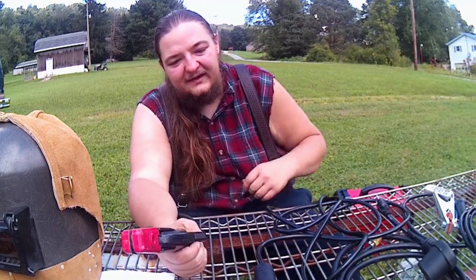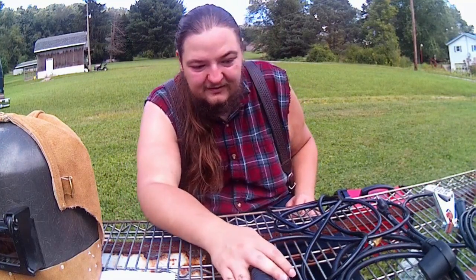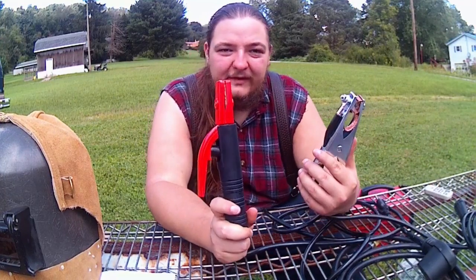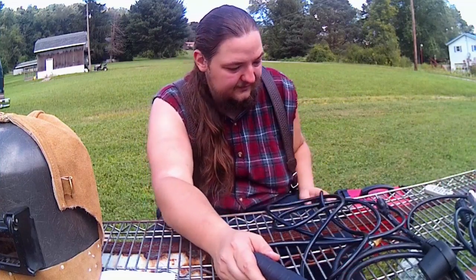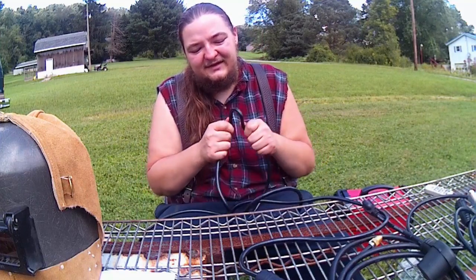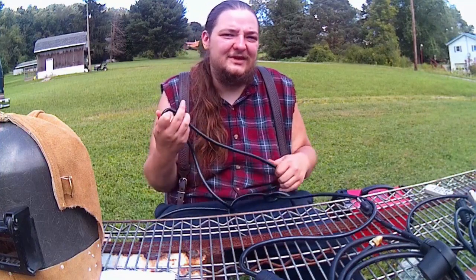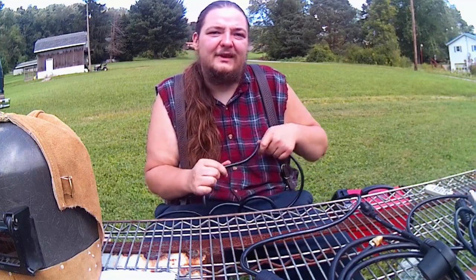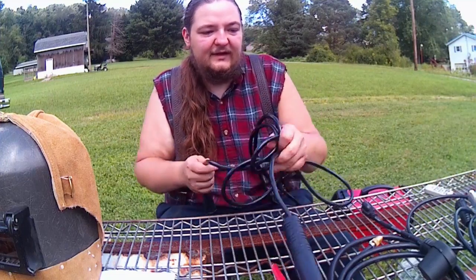So, that being said, the only thing I would tell Arccaptain about the leads and the ground clamps is, that's okay. These are consumable things anyway. You're going to replace them after so long, especially the ground clamps. They'll get cooked over time. I would definitely be upping the wire gauge sizes. This will work for all that the machine is rated for, but it will run smoother and last longer with the thicker gauge cables. But that's not too bad.